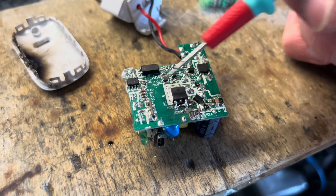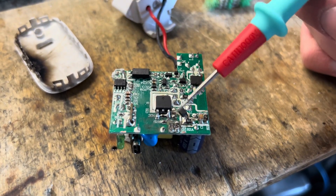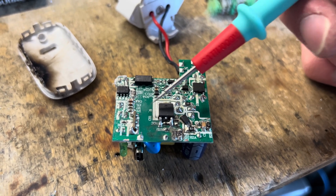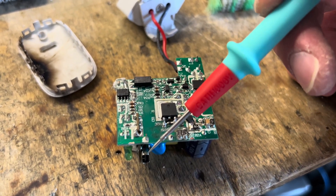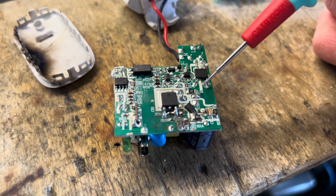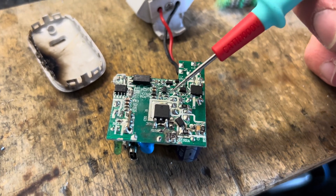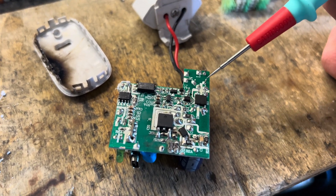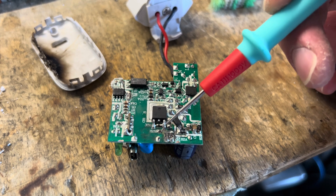It is something that happens, but the way it panned out wasn't really a good result. If you're designing this kind of product, you need to have the proper resistors that do go open in case the main switching transistor goes short. And on the secondary, you need to have some sort of protection. Maybe this short happened because too much current was being pulled. The fuse did blow, but it wasn't fast enough, because this takes a fairly large amount of current to do this kind of damage.